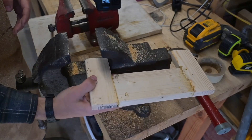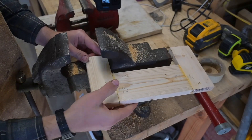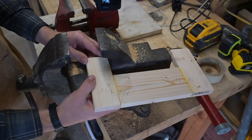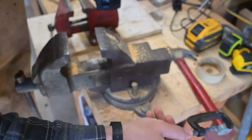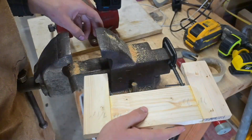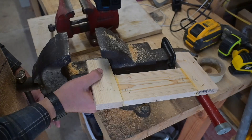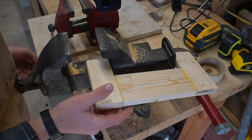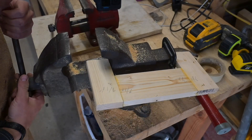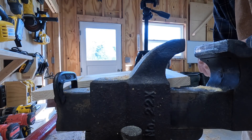First test is going to be pine — we're going to work up in the thickness. We're going to use this one face up. So 7/16ths on this side, 3/8ths on that side. Let's see who wins. Flush on the end, then we have contact. Point of contact is right there and right there — that's pretty even. Okay, here we go. Everybody's filming. I really can't say which one's going to break. This is going to break pretty quickly though, because it's pine.